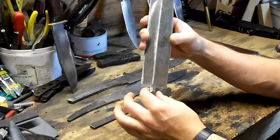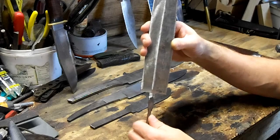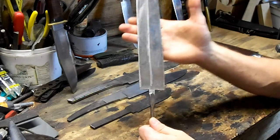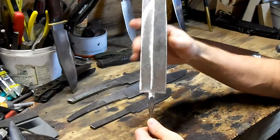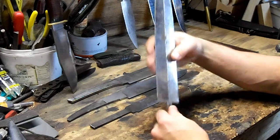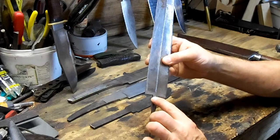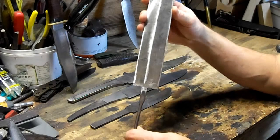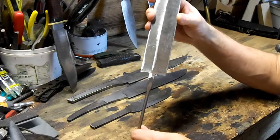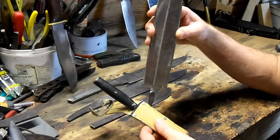Instead, stress builds up on these nearly 90-degree cuts right here. Also, the tang is narrow, and I assume it's heat treated the same as the blade, if at all. This is a Pakistani-made Arkansas toothpick blade that I've been using as a trainer for many years. I don't use it for a lot of rugged stuff, and I bet if I threw some gloves on to mask the sharp edges, I could probably break this tang with my hands, or at least severely kink and crack it. This is the worst tang you could have on a rugged-use knife.